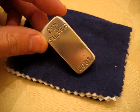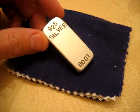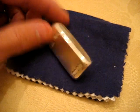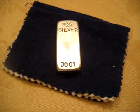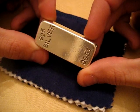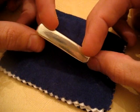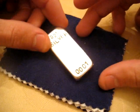The ingot I made in my first video got remelted with a little bit more silver scrap to ultimately make this bar, which is a lot bigger, a lot chunkier. So this video is going to be pretty much on the finishing process of how to get your silver bar stamped and how to get this nice almost mirror polish shine to it. It's going to show you how to remove all the borax glass after you've casted your ingot and get it to shine up really nice for you, like this one.